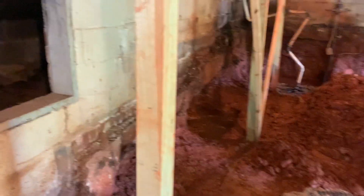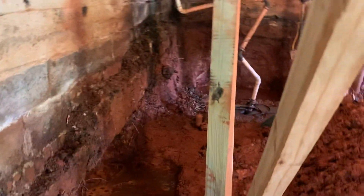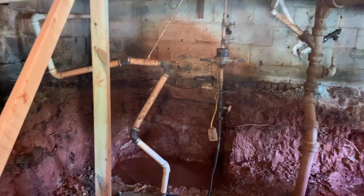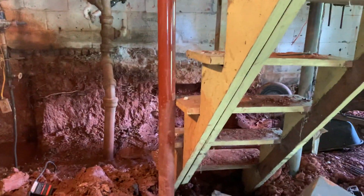The foundation is shallow. You can see how the foundation footing is up — we need to lower the footing to the level of the floor or below. We started doing some digging to set in the foundation.